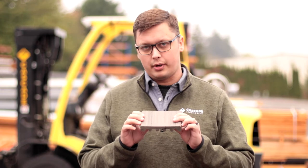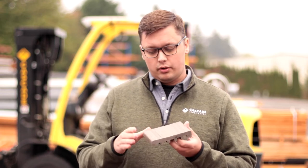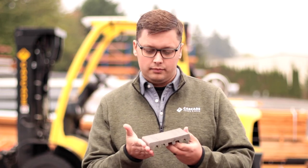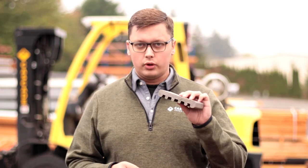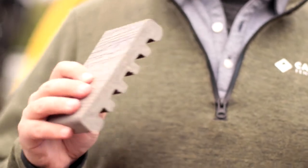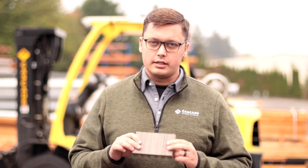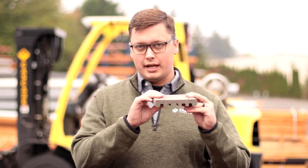Most wood-based composites are wrapped on one or multiple sides. This Enhance looks like it has a three-sided wrap — a full poly material that wraps all the way around the edges of the board to protect it from the weather. Wood-based composite material contains wood fibers that can be affected by the weather just like any other wood. If you're installing a wood deck, you know you have maintenance: you've got to stain it and seal it. This coating or wrap prevents that same issue with wood-based composites, providing a low-cost, low-maintenance deck board.